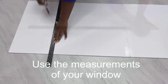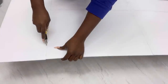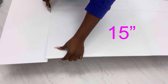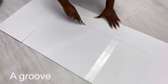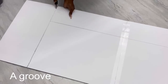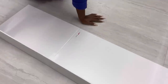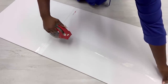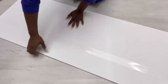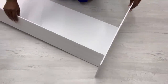The width is going to be according to how wide your window is, and the height I'm using for this cornice is going to be 15 inches. What's going to be at the top is going to be 5 inches wide, and I'm going to be making a light groove so the whole part does not come out — it's going to be easy and it looks like a flap. I'm going to use tape to secure it properly, and when I'm done I'm going to be holding everything together with hot glue.